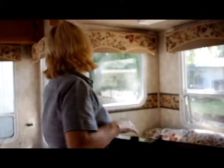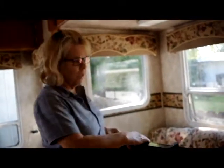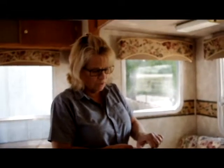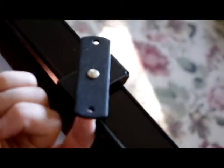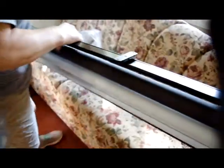This side right here is what makes it go slower and faster. That side is basically where the blind is going to stop — it's called the auto stop. Now we see how much room is up here. If there's a lot of room, leave them just like this. If there isn't room, we're going to twist those all the way down. We can twist them as much as so they're just barely coming up right against the rail on both sides.